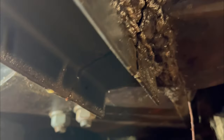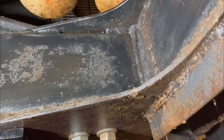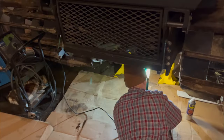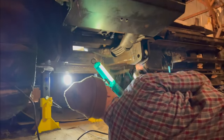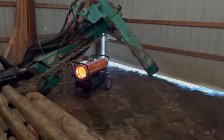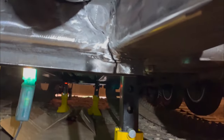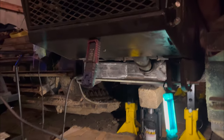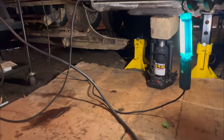There's our crack. You can put weight on the tracks — the crack is about three inches wide. Cleaned up. Pulled together with threaded rod; we used a porta-power and then used threaded rod to set it. Went ahead and threw one tack on there.